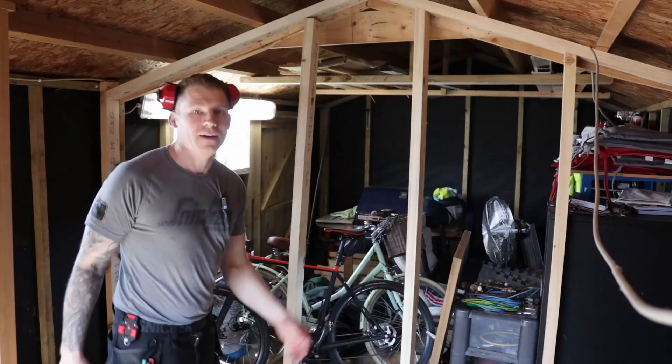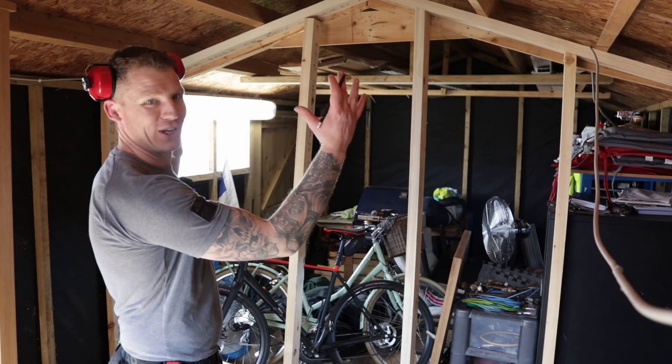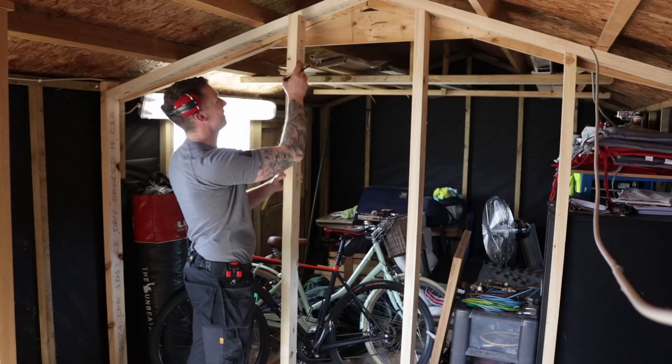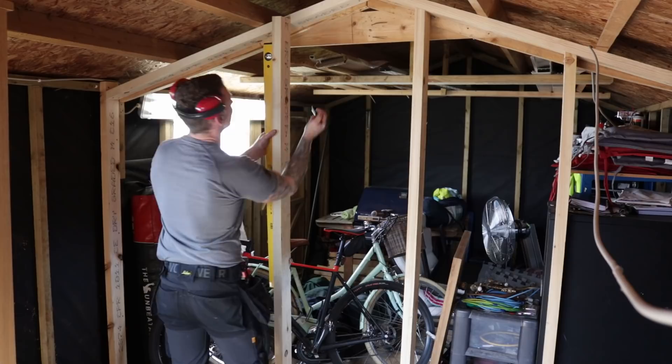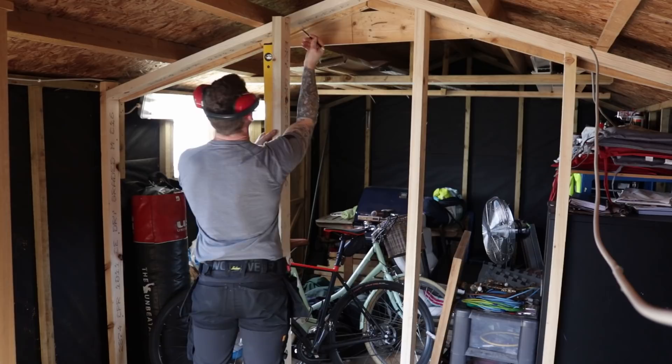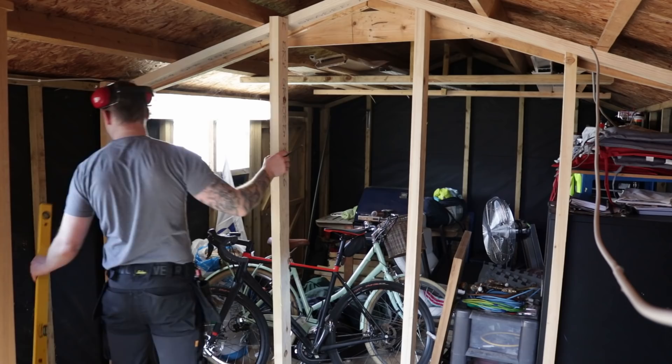The stud work is going up nicely. If you squint your eyes and shake your head really fast it almost looks like an actual carpenter did it — but the angles are all over the place because the whole shed is kind of tilted. When I'm doing jobs like this, I just cut things oversize, get my level, get it nice and level, then mark my angle. I know carpenters are probably screaming at the screen, but it's quick and easy and all the angles match up perfectly. Let's cut it and put it in.